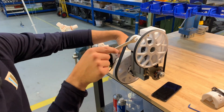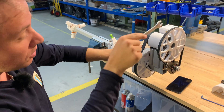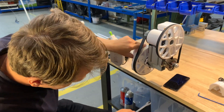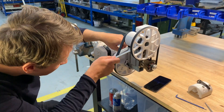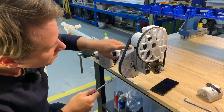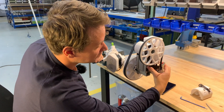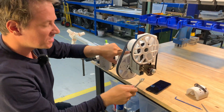Again I look up on the belt — it's running straight on it here, running in the pulley here. I can use a small tool to see it wants to rest on the outside flange. Maybe we should take it up a little bit. Now the belt is a little bit more over to this side — it's going to be pushed down as we tension this belt. There's not a lot of tension on this belt and you can see the motor mount is free to flex.